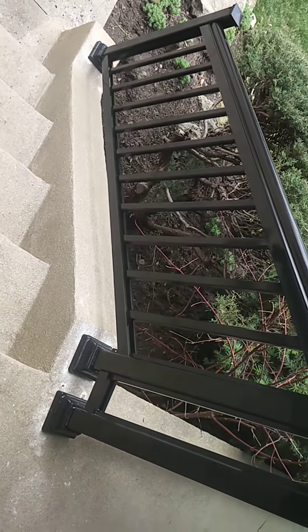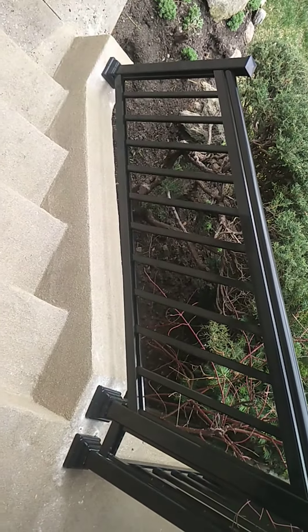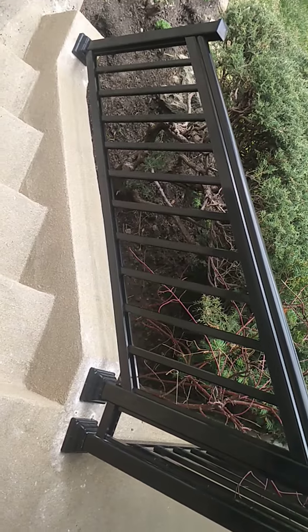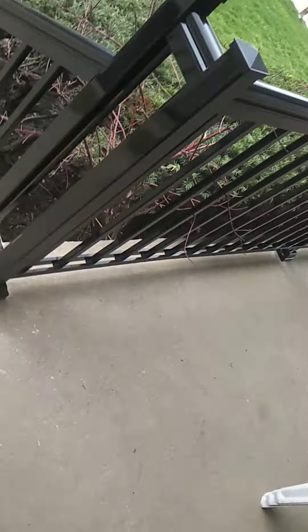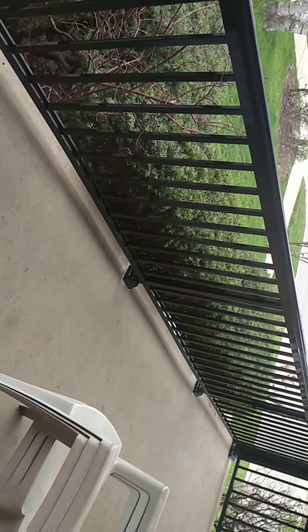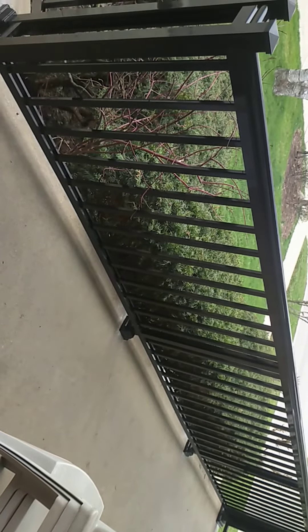The step is about 10 inches, but I've cut it down so the top of the handrail — what you grab onto — is 36 inches. The landing here is 36 inches from the floor to the top of the handrail. I've also installed inner posts, which I think look a lot fancier and more elegant.